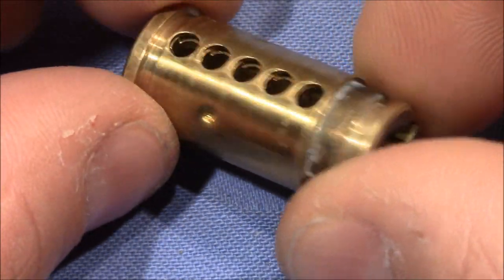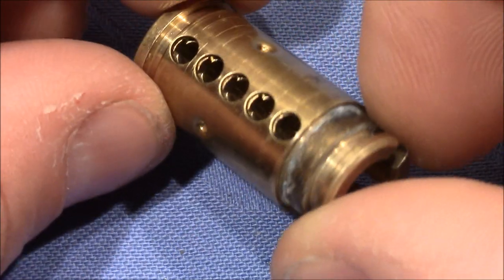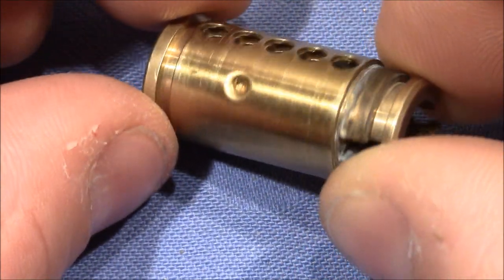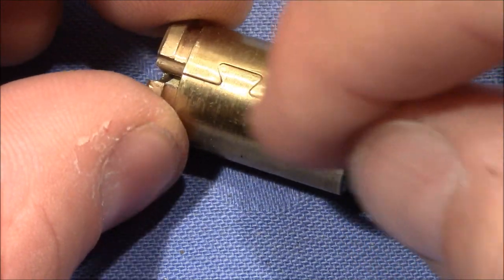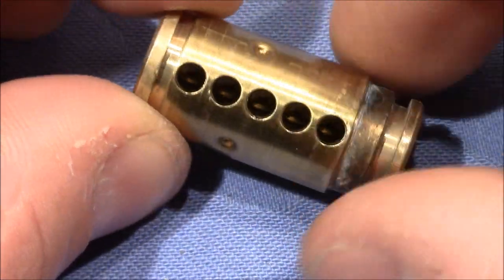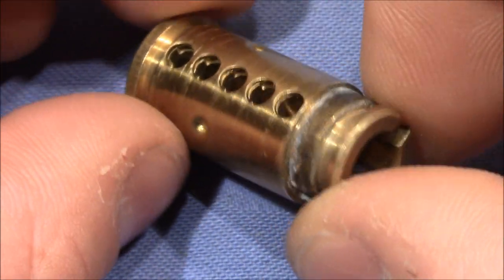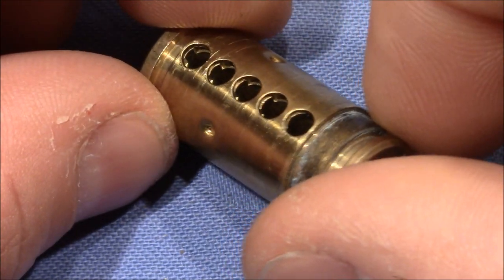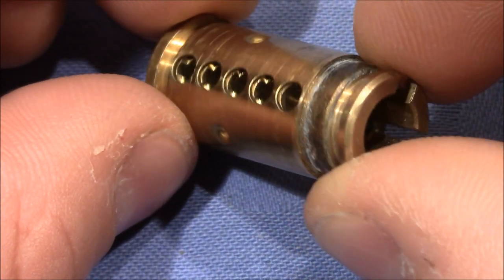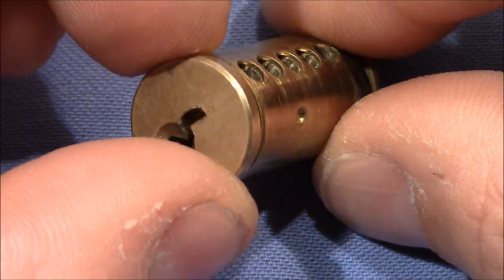I just realized how Ruko has achieved this deep counter milling on the plug. Here are two dents that give a hint that this is not a normal plug. What we can see here is not the surface of the plug, but a sleeve. Turning the plug around, we can see on the back how the two end parts of the sleeve meet, and the two dents left and right are fixation points so the sleeve doesn't turn or move. It looks like they filed or ground down the shear line of the plug and then put this sleeve over it, which results in a very deep counter milling. Pretty cool construction that makes this lock even more interesting and attractive.